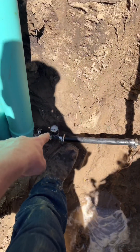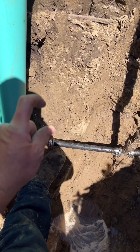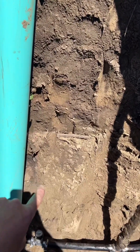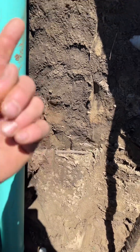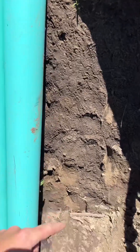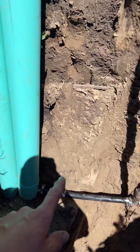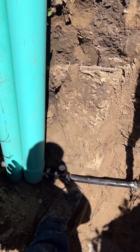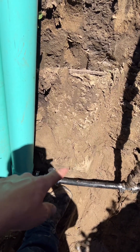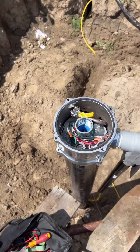Right here is where my pressure switch is going to go. I'm going to buy an electronic transducer — it'll be coiled up in a quarter-inch little braided stainless pipe so I can hook it and lift it out above the frost line whenever I want. There'll be a cap on there, then it'll go to the junction box and my electrical panel. When I'm ready to valve this whole system in, if my other well goes down, I'll rely on that pressure switch to cut the well on and off.